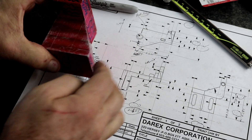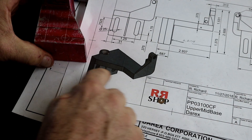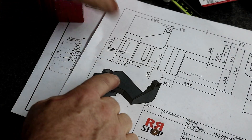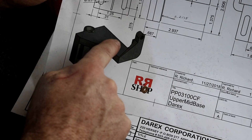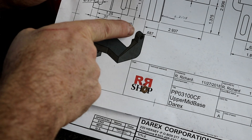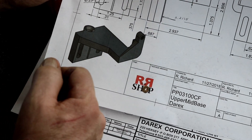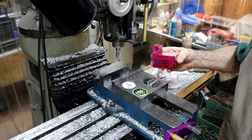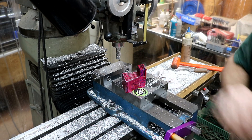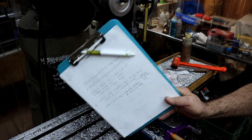That'll be one of the last things I do — to finish this off. Here's a reminder of what the picture should look like when we're done. That underneath side I'm not going to do until the last step. Right now I'm going to do all the features up here: finish this surface, drill, and the chamfer, get this side profile roughed out. Always helpful when doing complicated parts or complicated processes — write it down, write down what you're going to do.